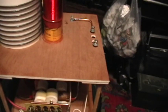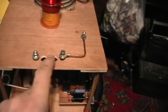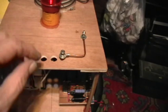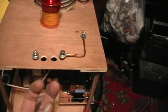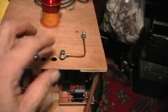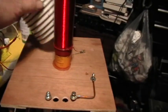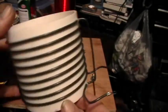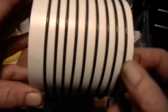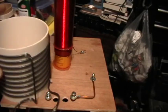Over here I've made a couple of improvised high voltage feedthroughs. You can see I had a couple of false starts and experimented. You have to have enough distance so it doesn't arc across. Over here is where the ground terminal goes — that's where the feed wires from the cap bank and spark gap come up to feed the primary of the coil. The primary itself is nine turns wound on a four-inch PVC form, spaced very neatly. The spacing and layout contribute to the overall Q of the coil, and you want that as high as possible.